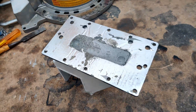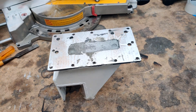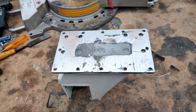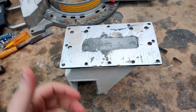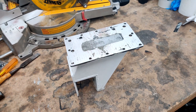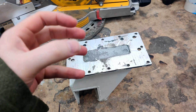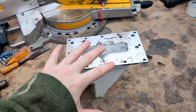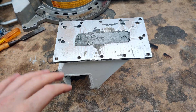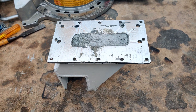So what is grout? It's a mixture of sand and cement and it has plasticizers so that when you're mixing it, it flows better. In the case of the one I use, it also has some expanders — that helps as the mixture of water is happening, it'll expand slightly, or non-shrink I guess you could call it as well. In my case the stuff I have expanded a little bit, like maybe one to three percent.